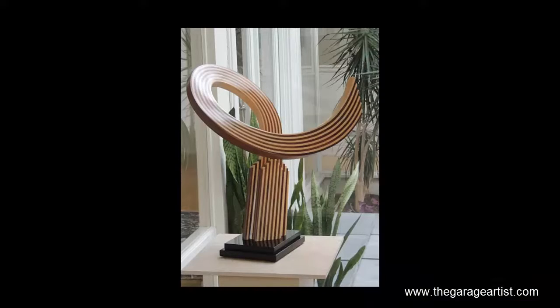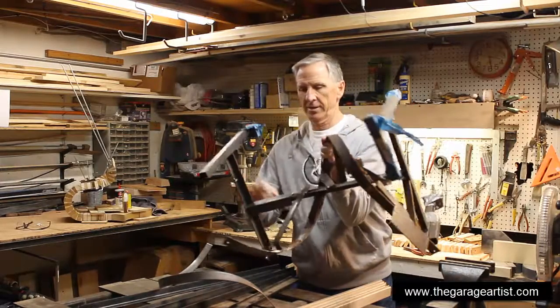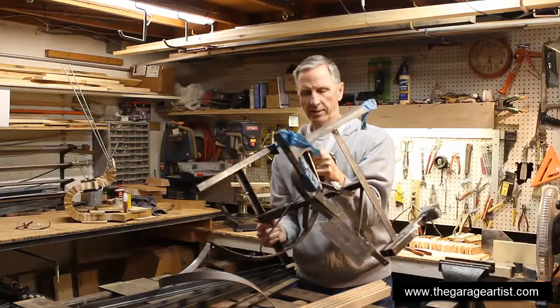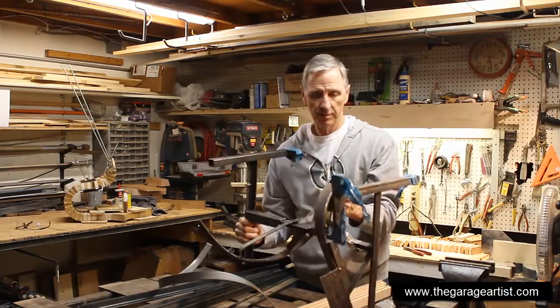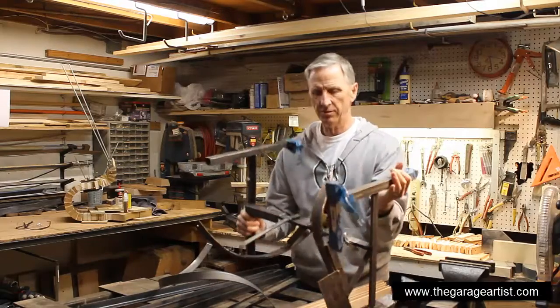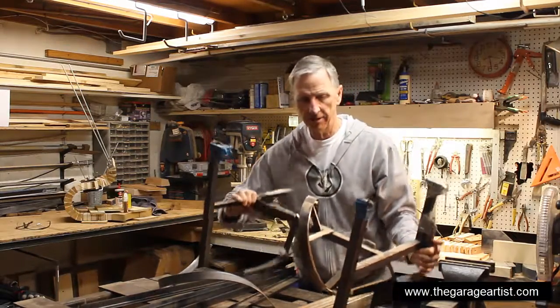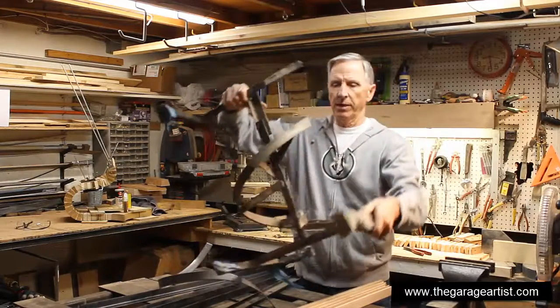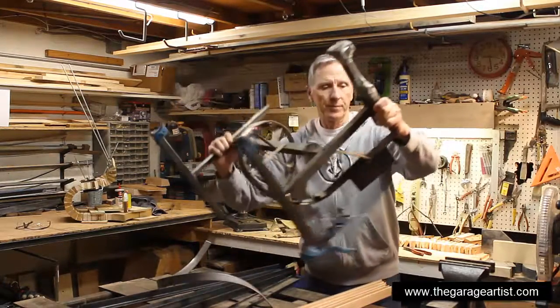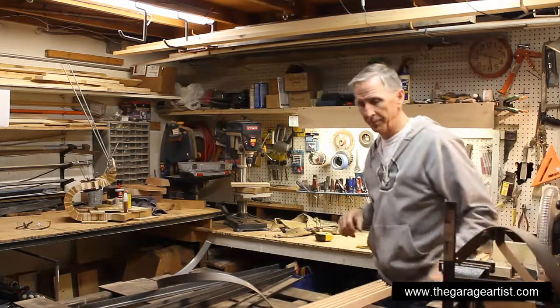Now, it didn't look like much on here, did it? So you take that and you weld it to some various support braces or whatever, because as you're clamping wood to this curvy thing, you have to twist it and clamp it to a steel table, keep it nice and solid. So this allows me to turn it many different ways and clamp it to the table, and that way I can steam and bend.